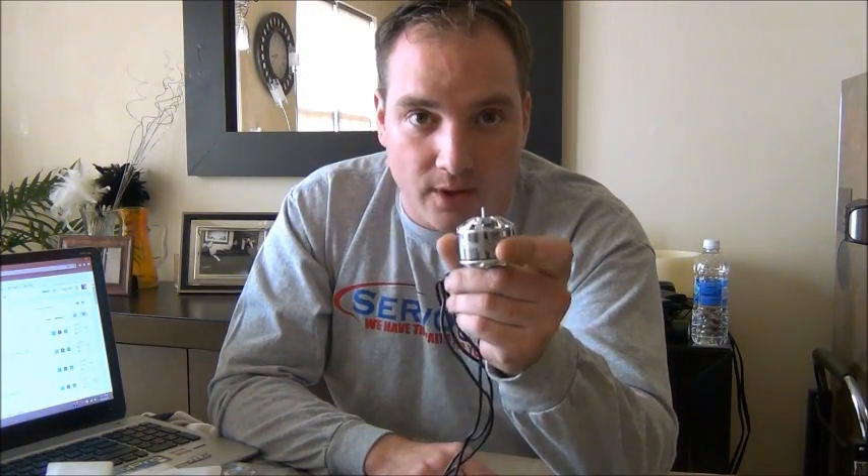They've updated their video to link to this one for safety. Use thread locker on the motor bolts. And again — if you're updating firmware on INAV or plugging this into your computer for any reason, if you're connecting a flight battery, take off the props. It's not worth the damage to your house or your hands. This guy's wife is upset because his fingers are all messed up. This is an important safety message for all quadrotors. Take it seriously — these things have a lot of power and they're not worth getting bit by. Stay tuned for more flight videos.